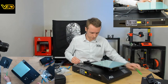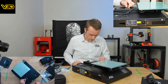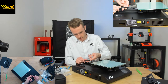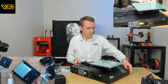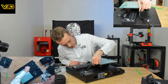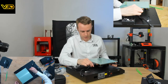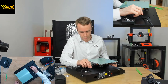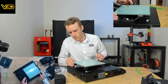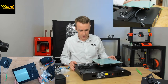I think this printer, the Labis one, came with some issues. We had to do some reassembly right at the start of the stream to get everything lined up. Was that this printer? It might not be. This looks very similar to what I remember, though. Really bad connector here. This is just terrible. It doesn't really support it very much, and this solder connection is directly on the other side. There's no real strain relief for that cable. It's all kind of kinked already. So is this going to be a fire-resistant Anet printer?